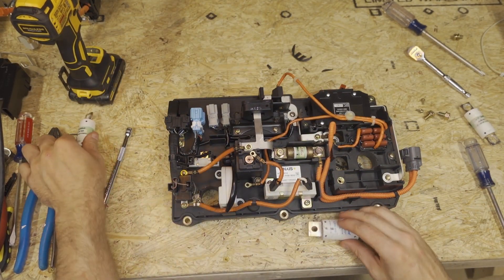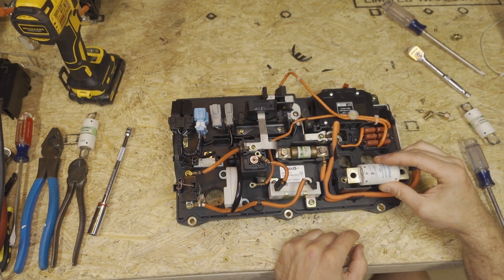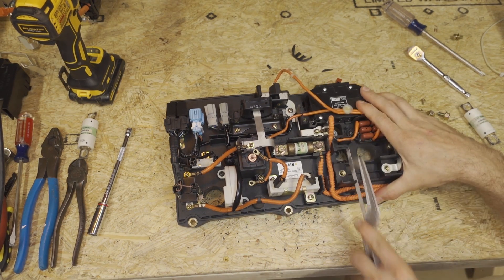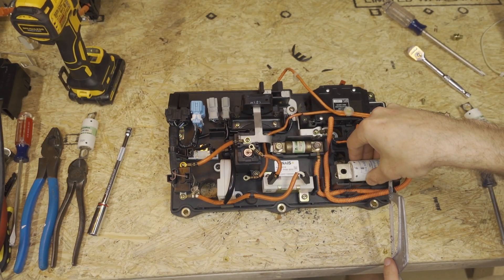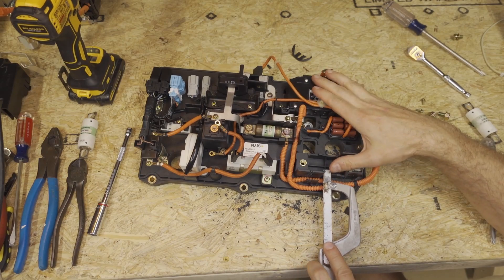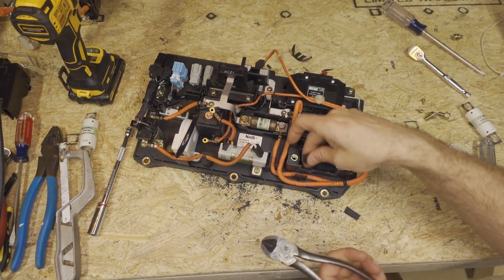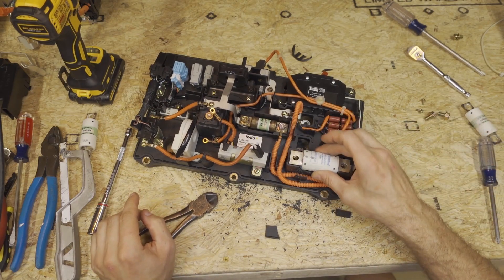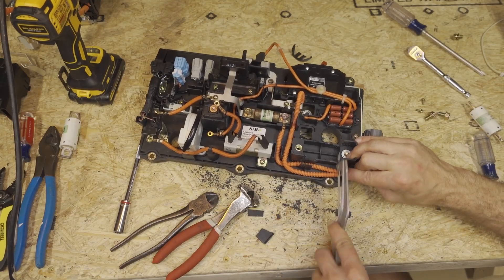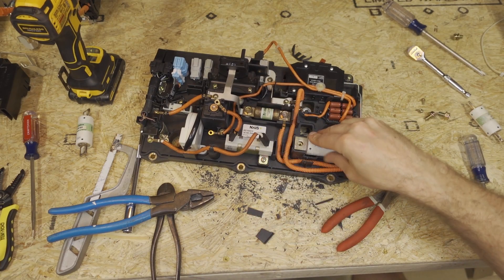You can see the larger diameter very clearly, and because of that it won't fit. So we need to cut material out until it will fit. Make sure you don't cut the HVDC cables. I'm going to cut here, cut there, and cut about right here, then cut this tab off and come over here and cut this tab off. You can take wire cutters and come in here — see how fragile this material is — and keep cutting down until the fuse fits. If it doesn't go all the way down and flush, you can't screw it to make it fit — that won't work.